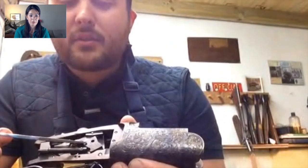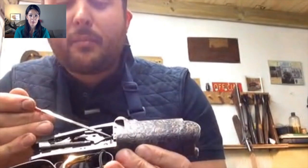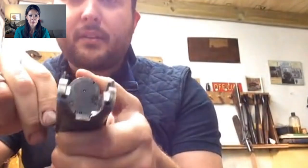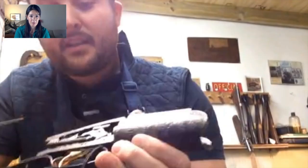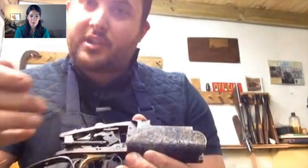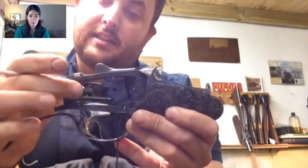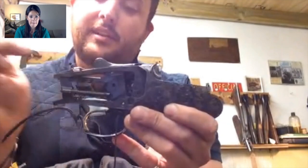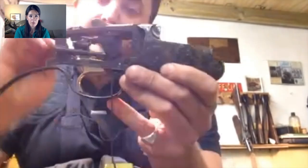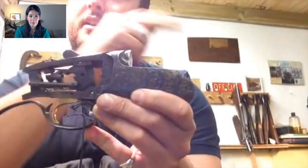This here is what's known as a tumbler, and that is what strikes the firing pin. These are your main springs; your sears sit on here, which the trigger is connected to. It's all a chain reaction: you pull the trigger, that raises the tumbler. This is called the inertia block — that goes forward and intercepts the sears. When you pull the trigger, the sears go up releasing the tumblers, which hits the cartridge and goes bang.